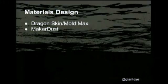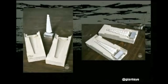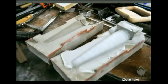We made some improvements. Moldmax and Dragonskin — the two silicones by Smooth-On — work marvelously for this process. Here is the new method: a wax core. Jim Brett pours up a new tentacle and here it comes out of the mold. Wax is easy to produce, easy to find, easy to manufacture as flat pieces using 3D printed molding. All that happens is we cast the silicone in and melt the wax out.